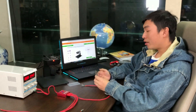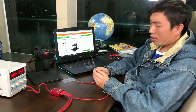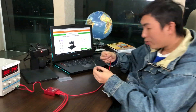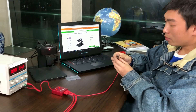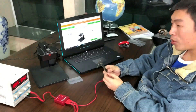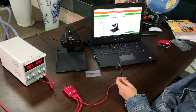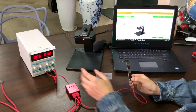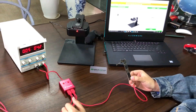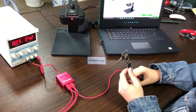So today I'd like to show you a case with a problem motherboard and show you why it's worth $900. This is an iPhone 6 Plus motherboard with an electric leakage. I've connected the motherboard to the power supply, and normally if you don't power on the motherboard you'd have no current, but it already has a 50 milliampere current — which means something is wrong.